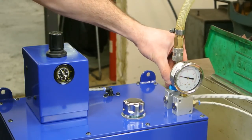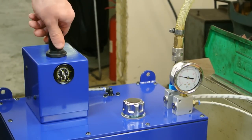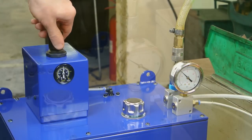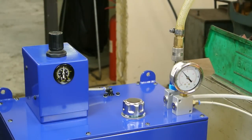The air regulator will begin to pulse. The frequency of the pulse can be adjusted by lifting the timer adjustment screw and turning in the relevant direction required. It should pulse at least once every second. Be sure to push back into the lock position once set.